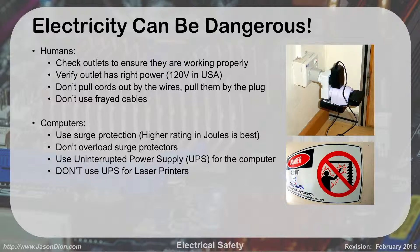Don't overload your surge protectors. We've got the six-port power strip, and people plug one strip into another strip into another strip because there aren't enough ports. That's dangerous — it adds too much resistance, and more resistance adds more heat, which can create a fire. You want one surge protector going into one wall outlet. Don't put too much stuff into one protector. This is really common during Christmastime when people daisy-chain surge protector to surge protector.